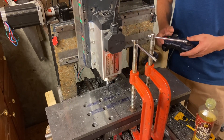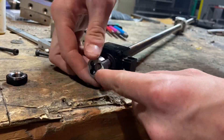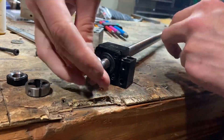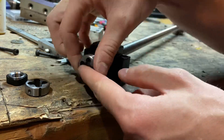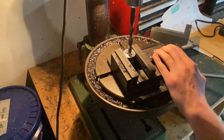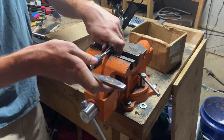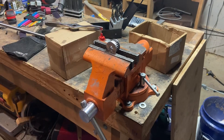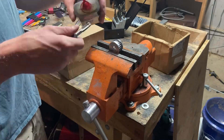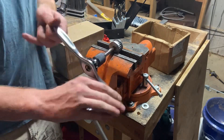As that finishes up milling, I'm going to move right on. I kind of skipped to a different part of the project here and actually started trying to get the pulley on the end of this lead screw sorted out. Basically my plan is to use this pulley to both act as a tensioner nut holding the lead screw securely on the main support and also as an actual pulley that the stepper motor can drive the lead screw with. I have a very limited amount of space, so I tried to work both parts into the same component.